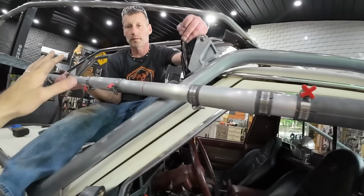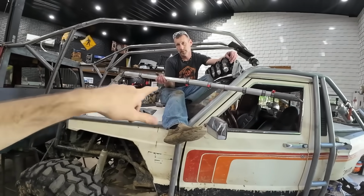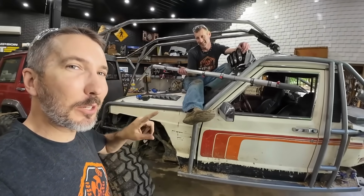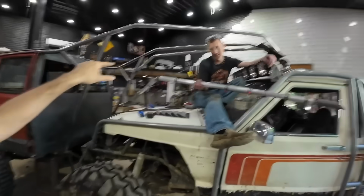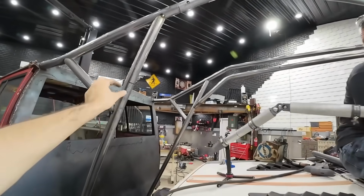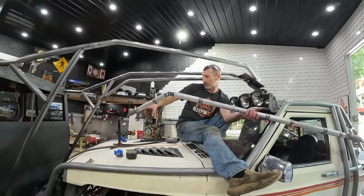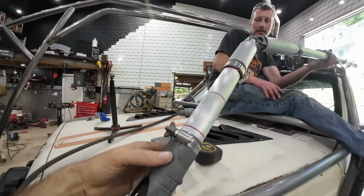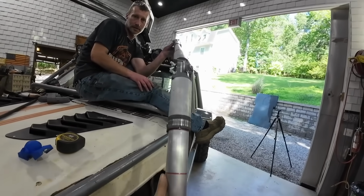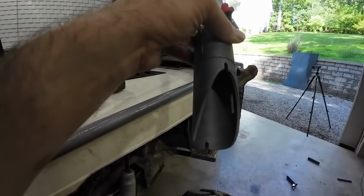You get that all laid out, and then you take that and lay it on the bench, and you just copy this with your tube. The thing is, will we be able to copy that on the bench better than we can just make it up in our brain on the other side? I guess we'll find out if the copes end up having a smaller gap. The answer will be yes. I think that's where it's gonna help, is the copes on the end. What's hard is figuring out, so we know that this is coped, but it's coped so that it's offset from the angle of the tube, and that's the difficult part.